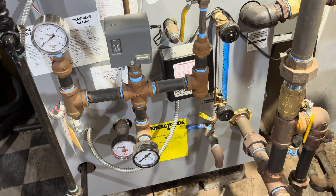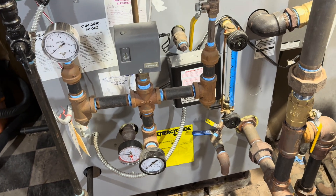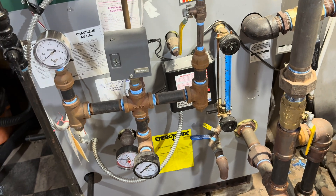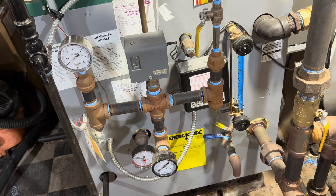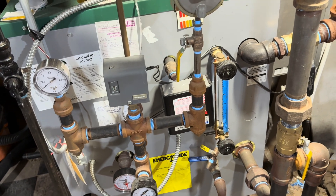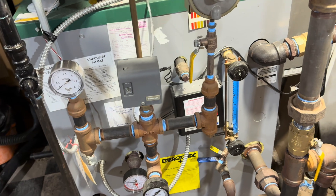One of those things is to keep the pH of the boiler water up around 10 or 11, which I have done for sure, and maybe even a little higher. But then I thought last year, like early in the season last year, I thought another way I could keep it from corroding would be not to introduce regular household water into it.